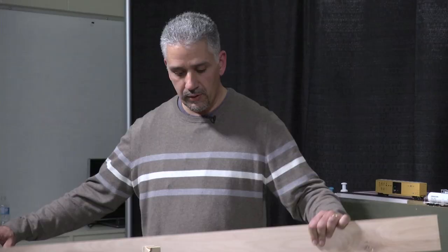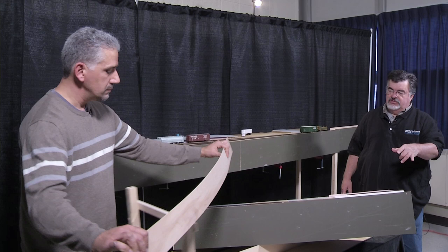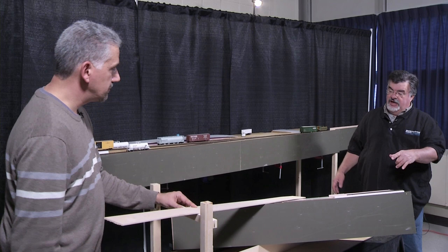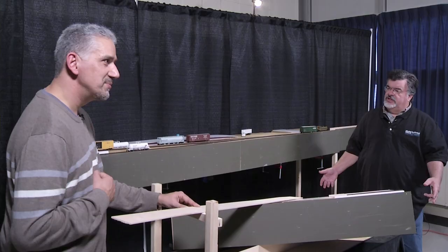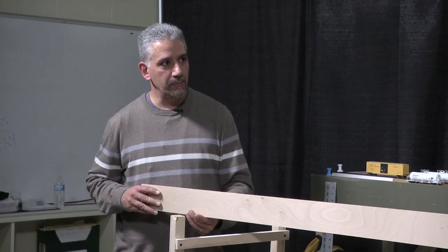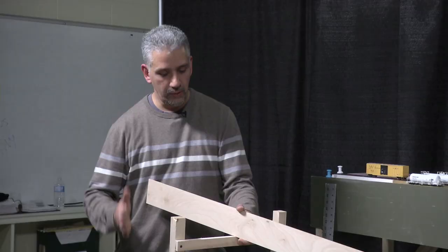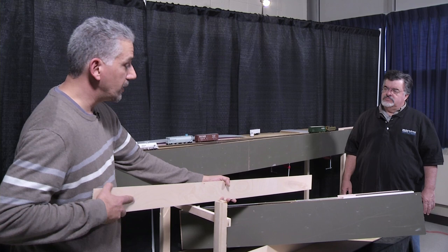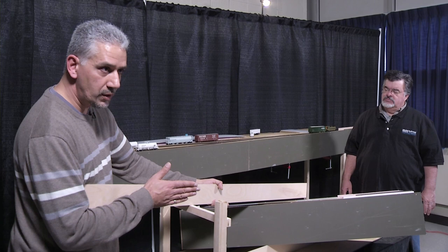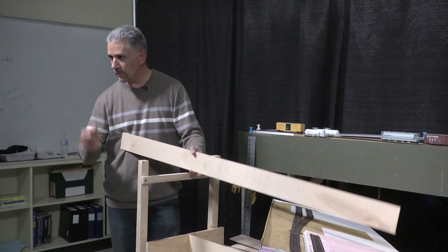How are you accommodating for curves then? Well, the nice thing is it's flexible. I can cut the tops out of a 4x8 sheet in a nice big arc or wave to make the edge of the bench work non-linear, and then I can bend these thin ribs to match. So you can actually make a curved module by bending those? Yes. You would cut the top with a jigsaw in whatever curve you want, put on the ends, and then start laying out the center rib. I like to use stone pavers because they're nice and heavy and don't move — you can hold them in place to keep things flat. Then the ribs in between will keep things from racking.